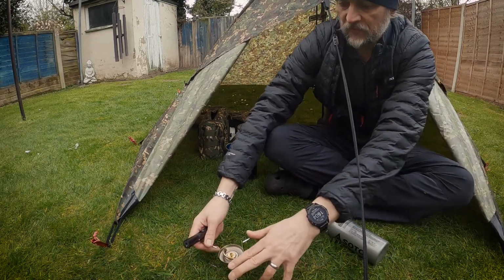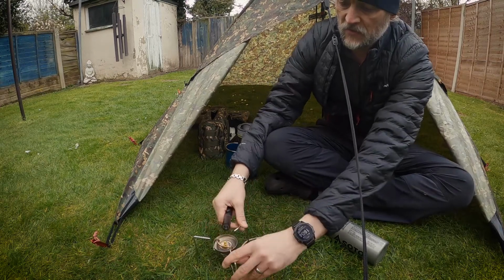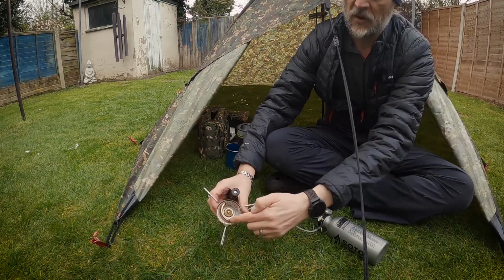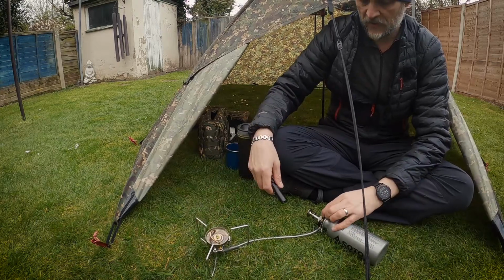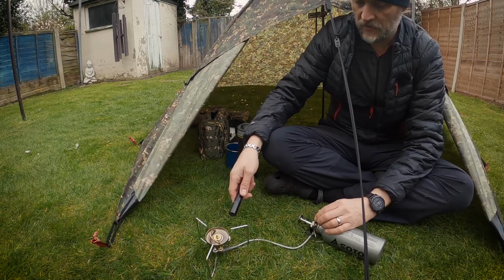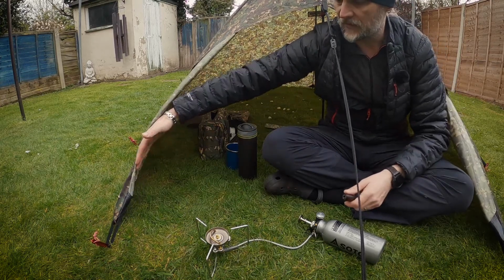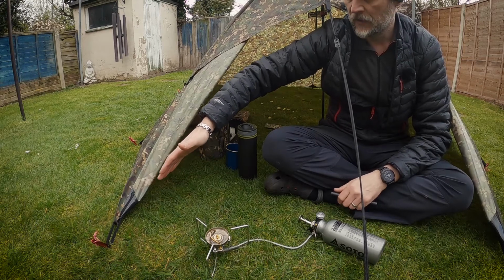and be on firm ground when you're doing it, is the initial outflow is petrol, and it's only when the petrol flows through this pipe that it gets heated and turned into gas. I mentioned that before. So pull up the stopper, turn it to the start position, and there we go. Now you probably can't see that very clearly, but I can hear it, and maybe you can too.